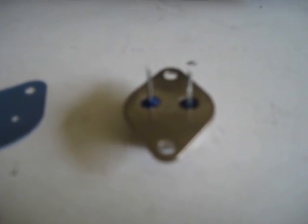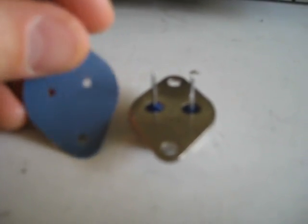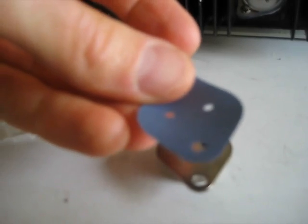Why is that a danger? If you look at your transistor, there are actually three conductive parts. This is your emitter, this is your base, and this whole metal surface area is actually your collector — so it's an electrically conductive component of the transistor as well. It needs to electrically conduct, which it will, but we don't want to electrically conduct to the heat sink — hence the washer. The washer isn't perfectly smooth, so we want very good connection between the washer and the metal surfaces. That's what the thermal paste is for — you put a thin layer on the collector so it'll be sandwiched between the metal and the washer, giving a good thermal connection.